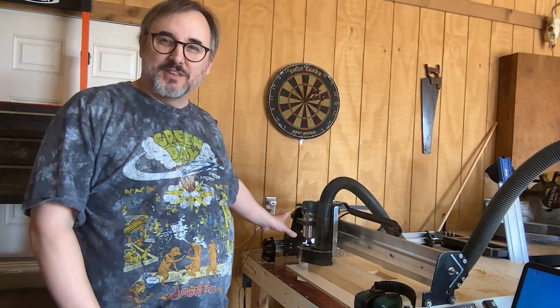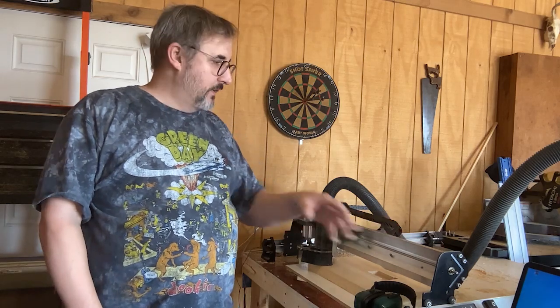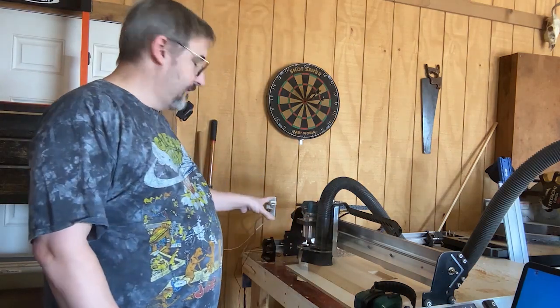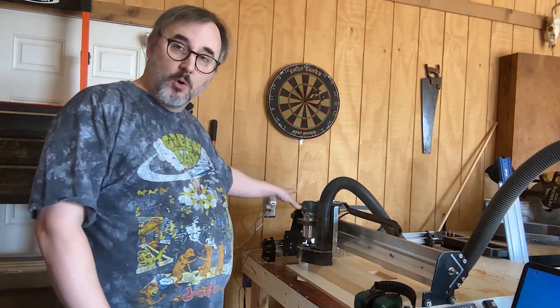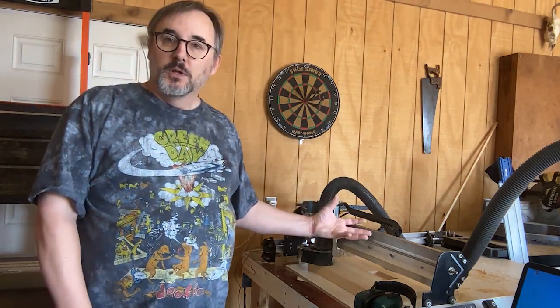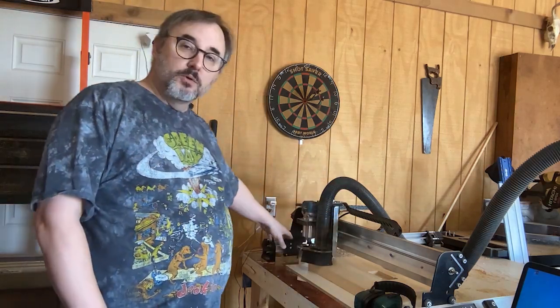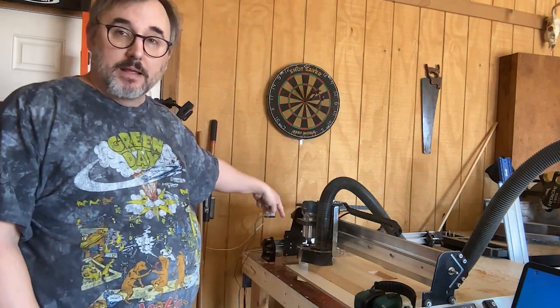Okay, we're back in the garage. It's actually been a few days. I had to go off and do my regular life, but I let the router stop right where it was, and I didn't reset my home or anything. So it should all be able to pick up right where it left off. If you have to, you can rehome it. If you have to do your cut job over a few days, as long as this doesn't move, that's where it started, that's where it stopped, that's your home.